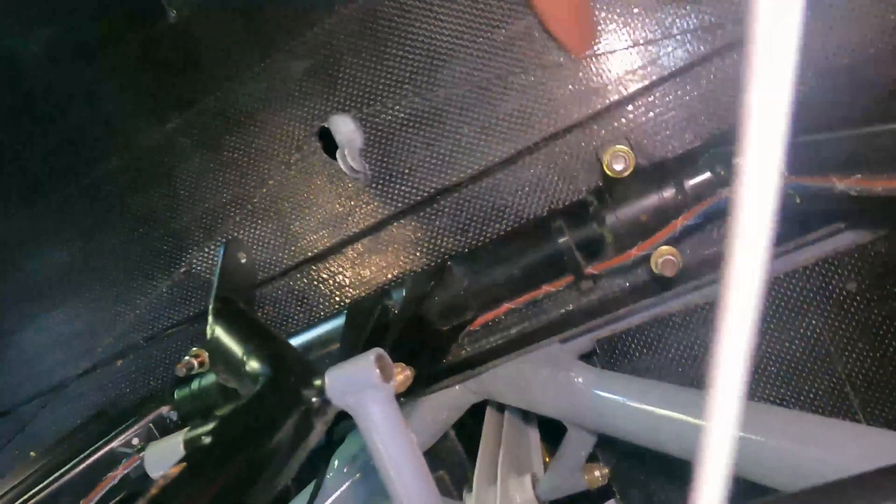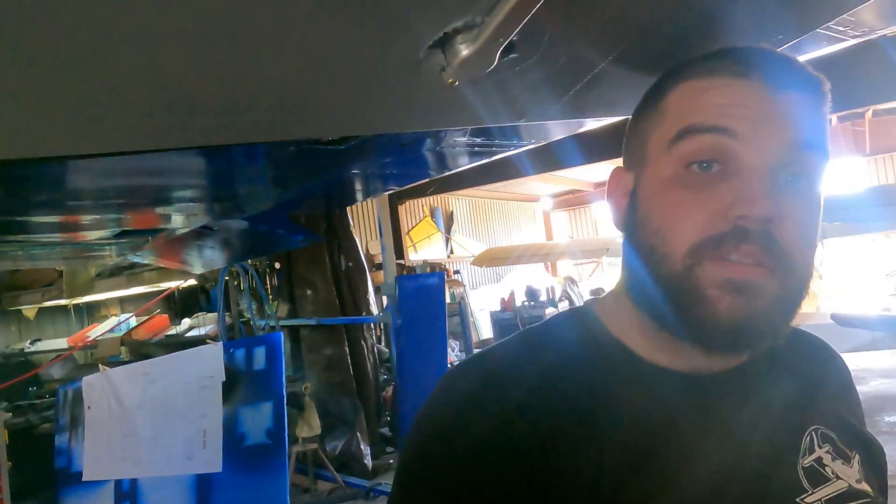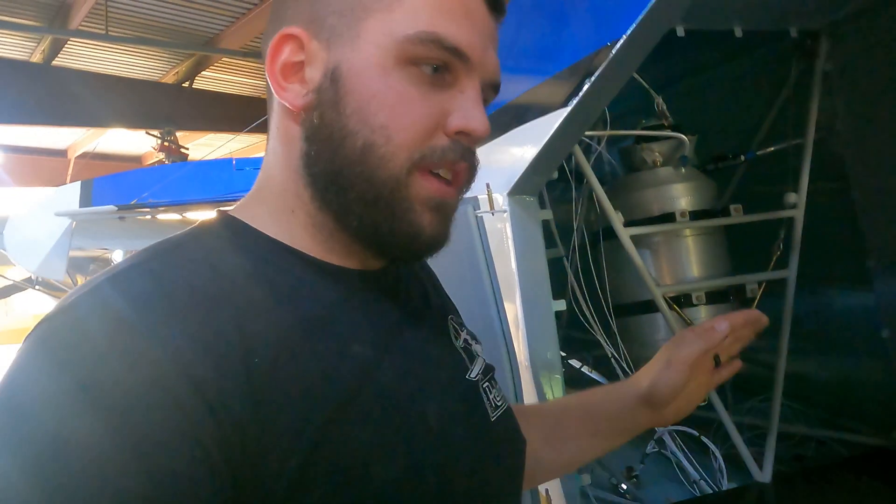On the front, we really wanted to contain the dirt up front. All your sand's going to come here — there'll be a little aluminum trim strip — and then all the way around this there's a little edge, probably about a half-inch tall. Even back underneath the control sticks, there's a little lip that catches all the dirt. So when you get in with dirty feet and hit the rudder pedals, all the dirt will get caught up there and won't rattle all the way down through the belly into the tail. When you're done flying, the airplane will be sitting in three-point and all the dirt should go to the back — you should be able to just vacuum it out without pulling the floorboards or digging through the belly.